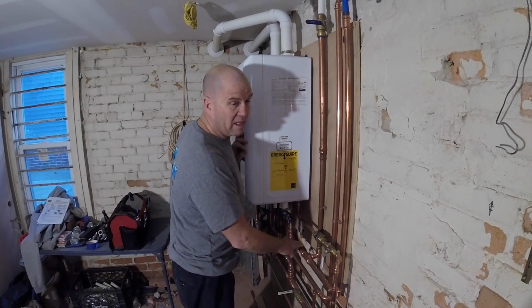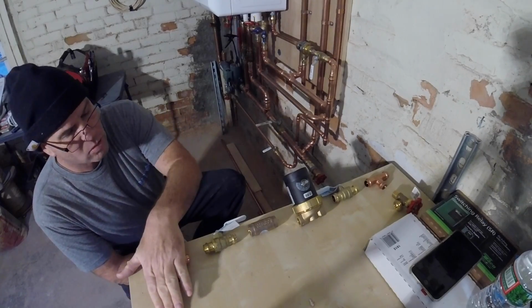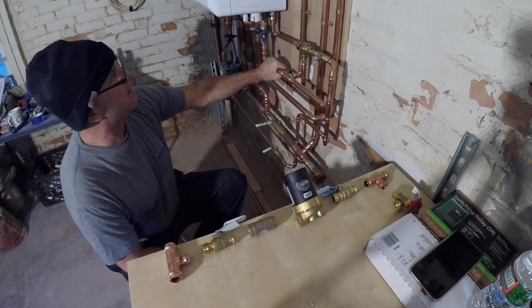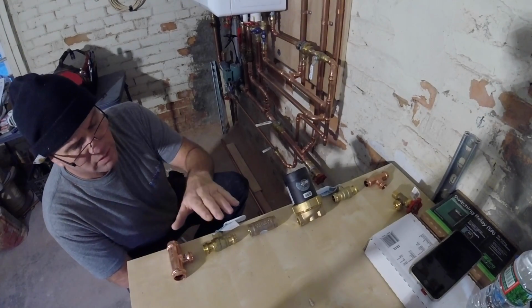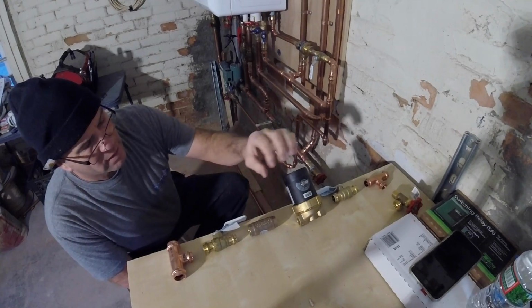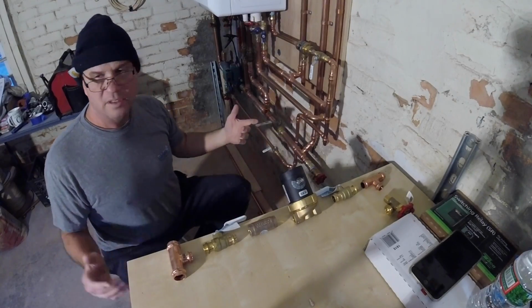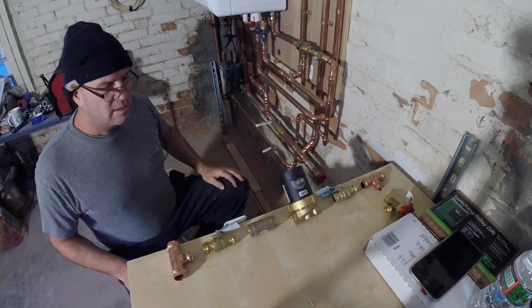We're going to add a recirculating line to the domestic side of the hot. Now here's our plan. We're going to tie it to the cold side. I called tech support for this. You can go to either the hot or cold side on the water heater. I'm going to choose the cold side because it's easy to get to right here. We're going to go straight up and tie into our prefab recirculating line. Here's the basic plan. Cut this in on the cold, valve it off. The direction of the check valve is this way, so the cold water can't mix. And then of course the pump itself, a valve, and over here will be a purge, so we can purge the actual recirc line, which is approximately 40 feet long, tying into our circ line up top in PEX. So that's the basic layout.